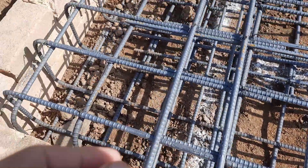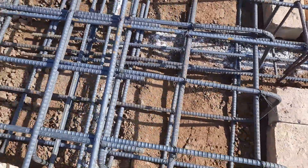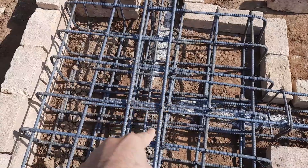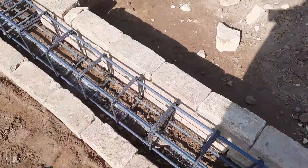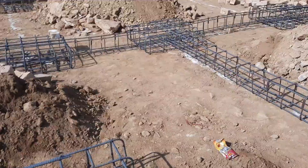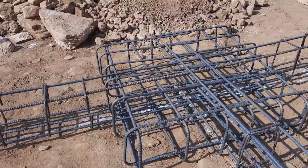You can see the steel reinforcement clearly. Hooks are bent at the end of the footing — they have already provided hooks with a minimum length of four inches. The bed depth is 12 inches with concrete cover, and they already did the shuttering specially for this, completed from brick masonry.